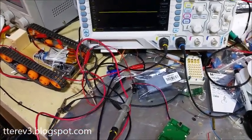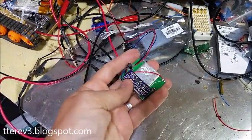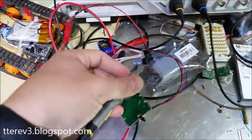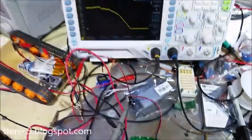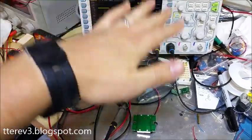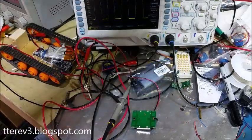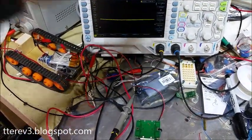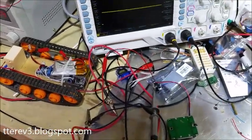Right now the scope is showing the amplified output, and I have that coming from my amplifier board on the back of here, and then I have that running into this microcontroller that I just threw together for a quick test on the quad. What it's doing is generating tones based on the speed. My hope is I can just strap this on the bottom of the quad for a quick test and get an indication of whether I'm getting a usable output from the Doppler module when it's looking at the ground.